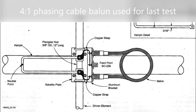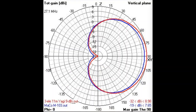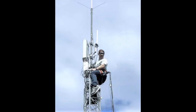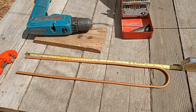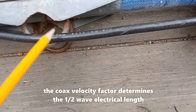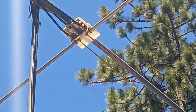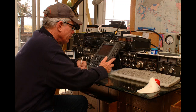So there you have it — the on-air testing of a few variations of the three-element Yagi, with the results nicely coinciding with the computer data. The additional gain shown in the computer-generated plots falls right in line with the real-world testing. However, I still desire a third form of validation: the test range. Stay tuned for following parts of this series, as Dan is going to be implementing some performance modifications to his box stock M103. For those looking to leap into the world of high-performance Yagis, I'm going to take a deep dive into this split-driven element, covering the dimensions of the hairpin, the phasing cable — which may vary depending on the type of coax you use — and construction tips ensuring you get the most performance and the best longevity, much like this 35-year-old split-driven element featured in the video. So with that, 73. Thanks for tuning in and tagging along. Greg Howe, S9 Radio.